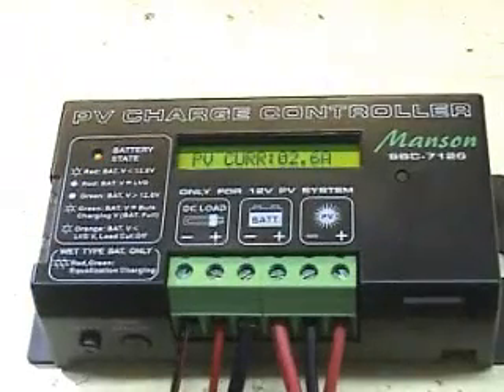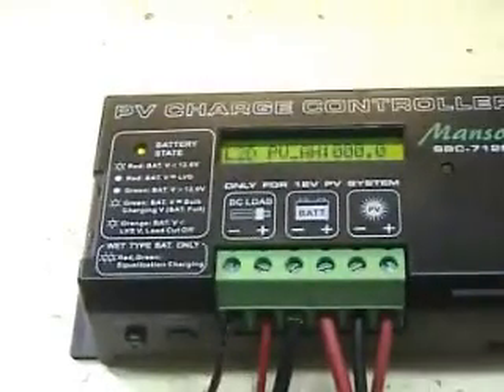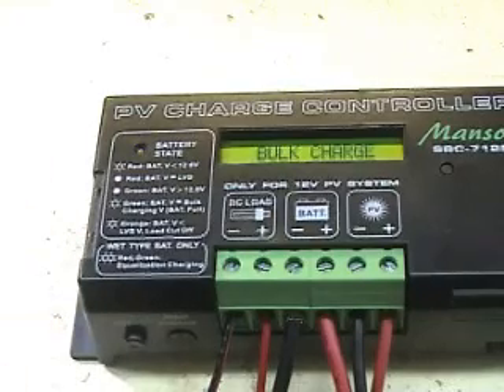To verify your night light mode option, take a look at the left panel again. Set dip switch one to the on position, then press reset to see how many flashes appear. You should now see four flashes, which means your 8-hours-on option has been activated.